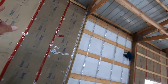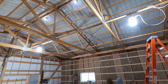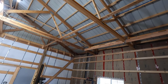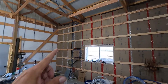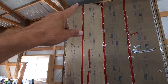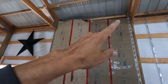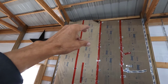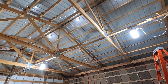Here's my thinking on this. I have to run this up across the top of the lower cord here. I'm going to go all the way over to here and then go on top of this brace, then across the top of that lower cord, and then over and down to the panel there. But on this side there's not a lot of support in the middle, so what I'm going to have to do is cut a 2x4 and go all the way across there. Then I can run the wire on the 2x4 and coil it up while I'm doing the rest of the work down here, and the rest will be fixed in place permanently.